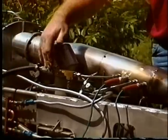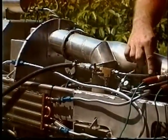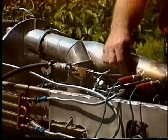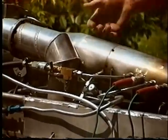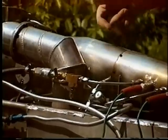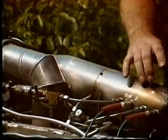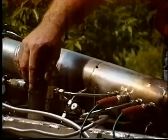Here we have our propane initial start header. We inject propane for the initial start and then we turn on the main fuel pump system, which allows us to start pumping kerosene into the combustion can, and then we're able to cut out the propane.